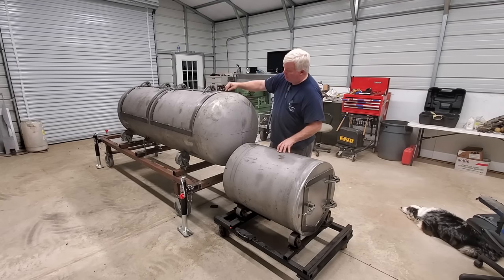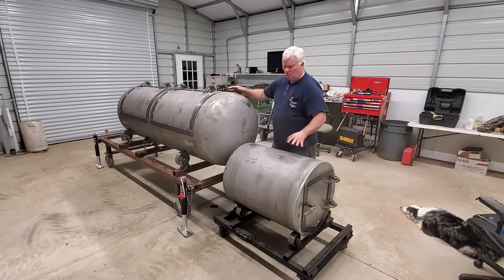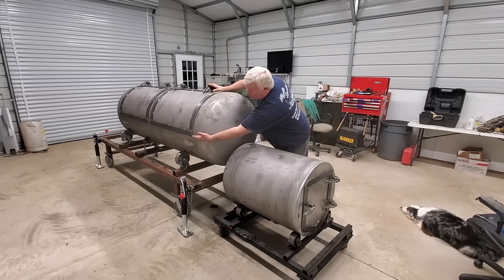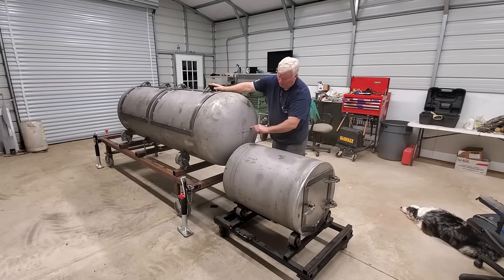If you'll remember from our earlier episode, we extended our center lines, our 12, 3, 6, and 9 o'clock, all the way around the tank. And we came up with a center line right here. That's a very precise center mark on the end of our tank. We have some decisions to make at this point. How high are we going to raise our firebox in relation to the grate? Remember, the bottom of the grate is even with the bottom of the door opening. But we're going to use one and a quarter inch angle for our grate framing, which is going to raise our grate 1 1/4 inches off of the height of that door, which is of course the height of the center line. So this line here, GL, is our grate level. It's 1 1/4 inch higher than the center mark.